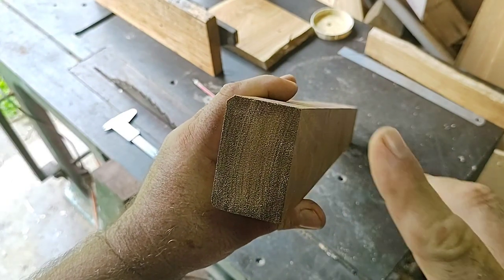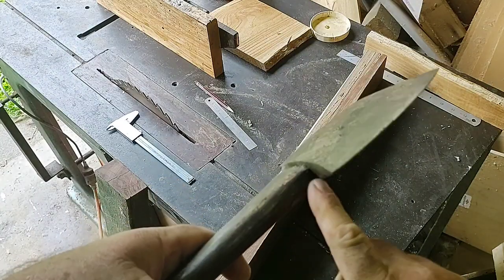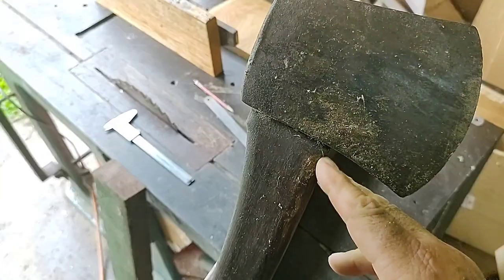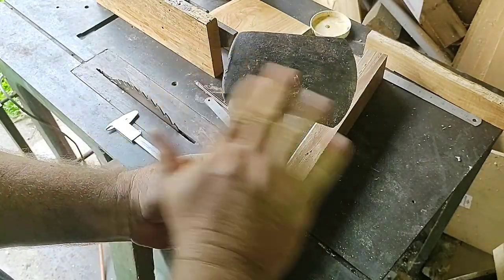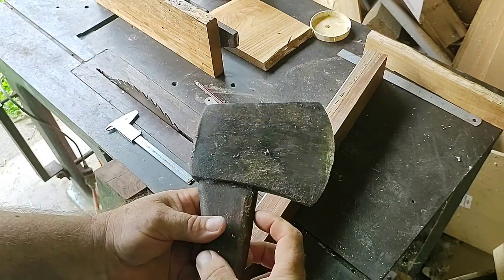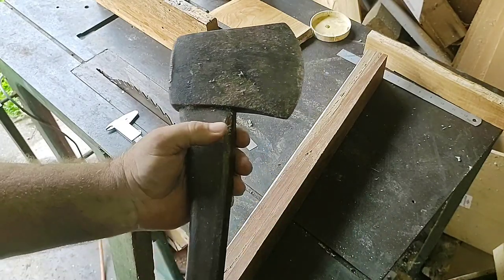When it's sideways, I'll explain that now, on an axe handle especially, this part of an axe handle sometimes cops a flogging. Cops a real hiding and some real abuse. And sometimes, if the grain is not this way, but this way, that will actually weaken that spot there and it'll splinter away, or sort of like barber chair away. It splinters away and it'll damage your handle.